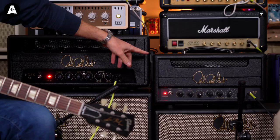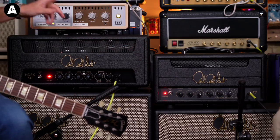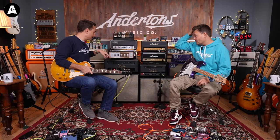So you'll often see amps with 5881s or 6L6s, because it's the same pin base and it is interchangeable. So 5881s here, and in the preamp section, three 12AX7s. And then in the big one, you've got three ECC803Ss, which again is another variant of that kind of preamp tube, of which there are copious amounts of debates online about why the tone is slightly different. It's tone wood. It doesn't make any difference. But I think it makes tiny amounts of difference, and then forums tell you it makes a massive amount of difference. And that's, I guess, subjective, right?